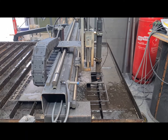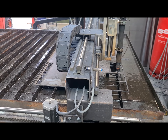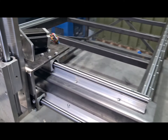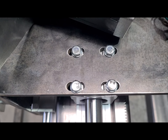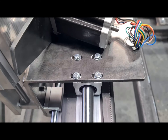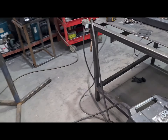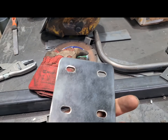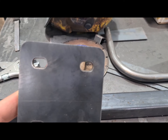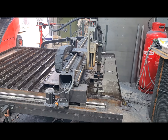It's a nice little build and it's been working - so consistent and insanely accurate for plasma. If I wanted to cut out a 9mm slot like I have in the tops of this, I get a 9mm slot - not 9.5mm, not 8.5mm, a 9mm slot. That is pretty awesome for plasma. Here's the other motor mount - those are the slotted 8mm slot holes. You can't tell me that is bad for plasma - it's on the money, and that came off that little machine.